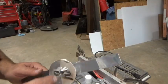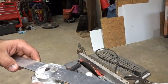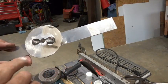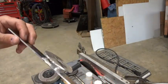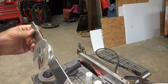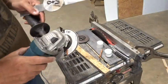It's cooled off. I've got a little bit too much material right here on this edge, so I'm going to take my flapper wheel and grind that down — same thing with this bubble right here, try to make it a little bit smoother. Overall I do believe it is on there and it's not going to go anywhere. That material is so light it probably won't make a big difference on a trolling motor that's running halfway out of the water anyway. I've got a 60-grit flapper wheel on here.